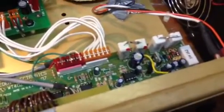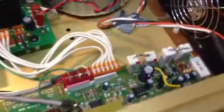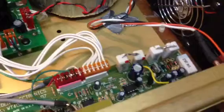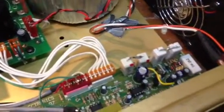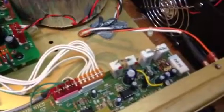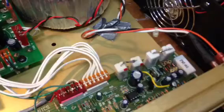So somebody had replaced these, and they had to jumper the wires to where they went, which was fine, but they did not jumper this last resistor right there. That one, they must have just felt that the trace was enough intact to the solder pad that it didn't need it. But over time, obviously, this is sitting on a 115 bass cabinet, so it's got a lot of rumble. That pad and those traces failed, and it broke away. So when I flipped it over, lo and behold, there it was, kind of just flopping in the wind. So that was the problem.